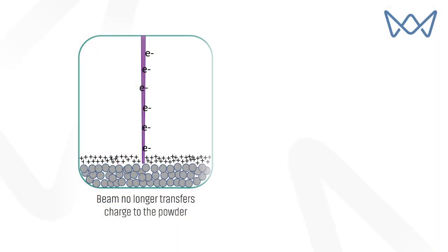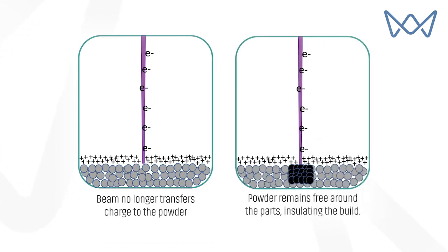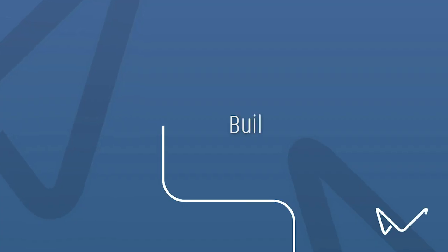This we've done, so we now have a very stable process — we don't need to pre-sinter the powder — and we can bring to bear all the advantages that electron beam technology has to offer. The energy transfer from electrons to the powder bed is a kinetic process: a high-energy electron beam becomes incident on the powder bed, the electrons transfer their kinetic energy to the static powder and thermalise within it. There's no additional coupling media needed, no additional gases, no expensive cross-gas flow. This means we can run at higher powers, with less contamination, and it gives us the ability to build larger parts.